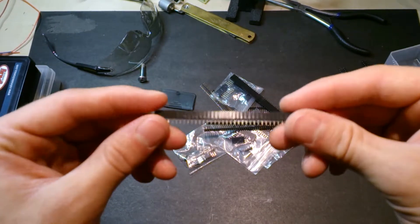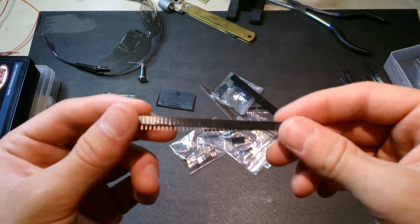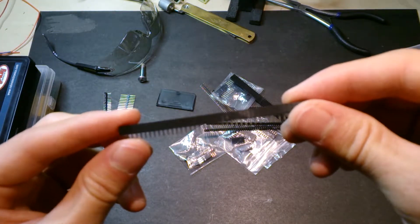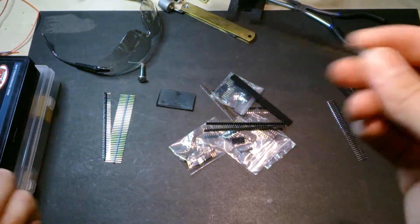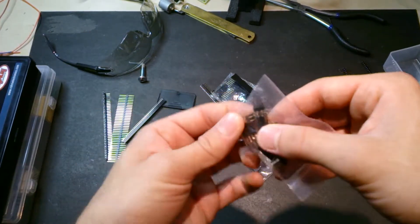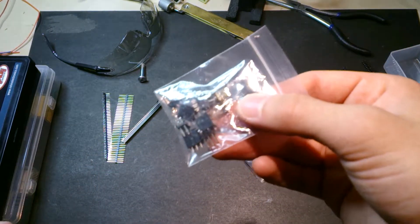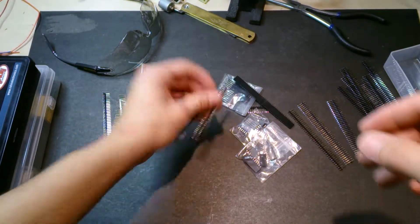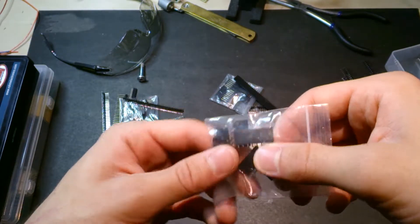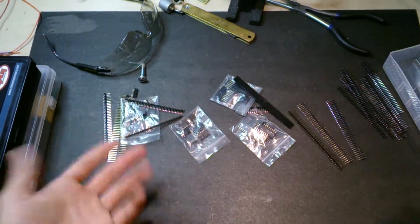When you get to two-millimeter headers, you don't see those very often. I'm using them on my quadcopter board because I've got an XBee-style wireless transceiver that uses two-millimeter pitch, but I've never seen two-millimeter pitch commonly used in open-source electronics, so it's a little worthless for general use. They also give you different shaped ones like a 2x3 100-thou — that's actually pretty good. And some right-angle female headers — I don't know what I'm going to do with all this.